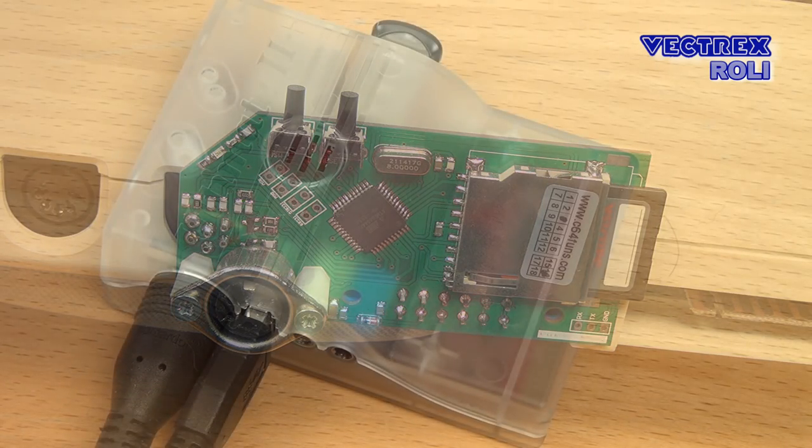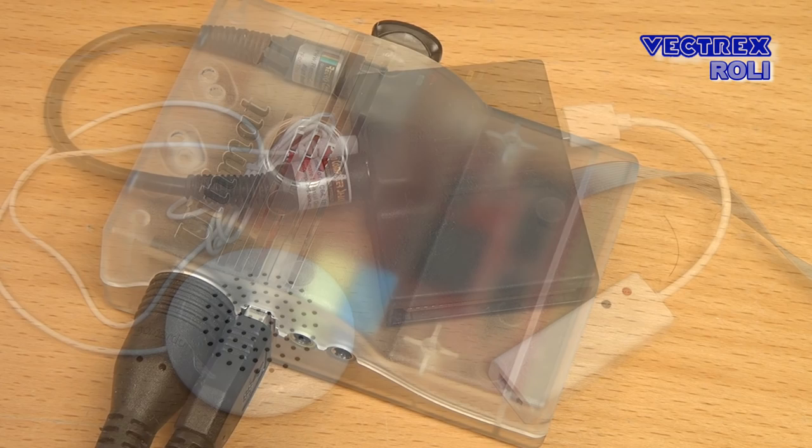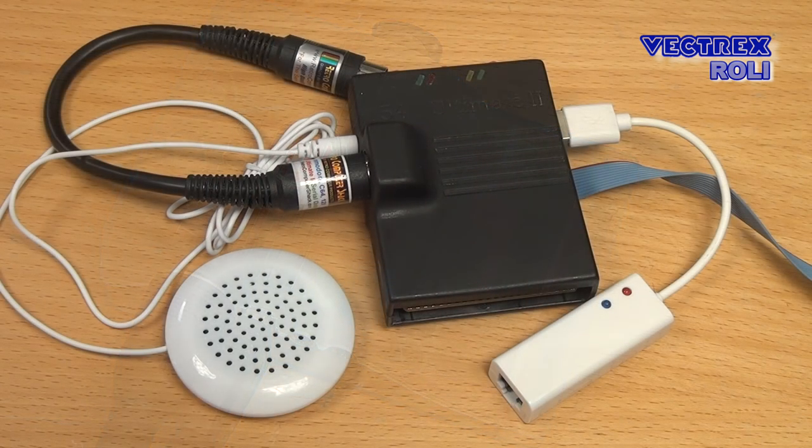As I got the newer 1541 Ultimate 2 Plus, I wanted to give my older Ultimate a new purpose. Both the Plus and Non-Plus version have the same basic functionality, but the Plus has some features already built in, like a speaker for disk drive sound emulation or an Ethernet plug. So on the older Non-Plus model, you need to use external add-ons for that, which takes a bit more space around the Ultimate, and all of that can be hidden behind the desktop case.